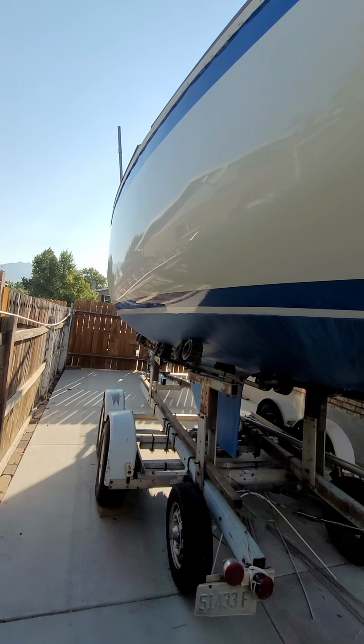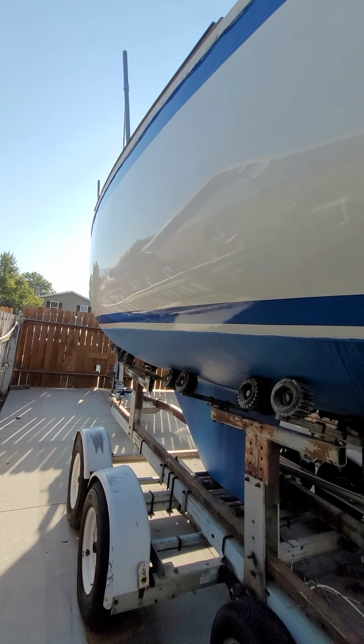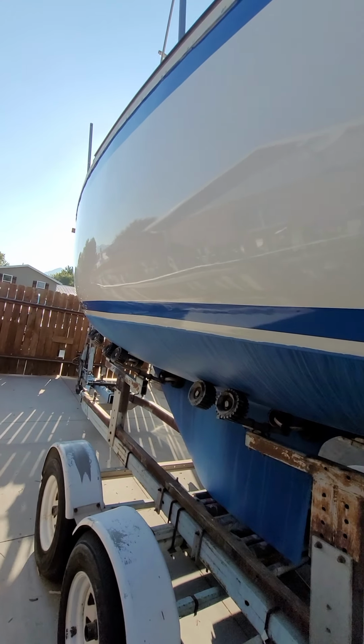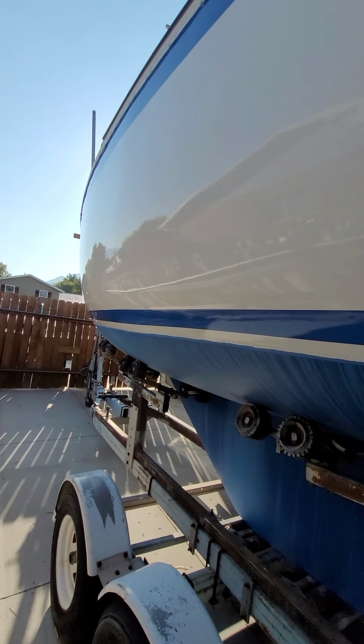Another thing to point out is that between each coat, I would wait at least 3 days. I tried doing a day or two after and the paint just wasn't quite cured. And this is with really thin coats. If you apply it too thick, you'll get a run. In fact, there's one right there.